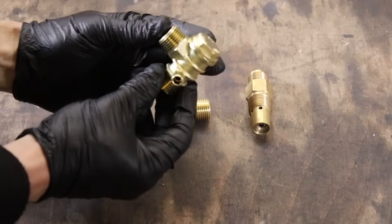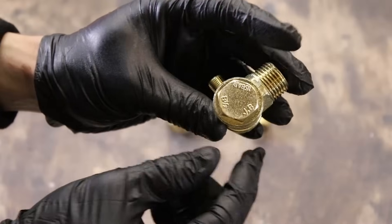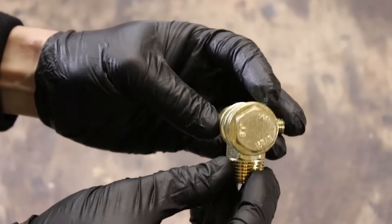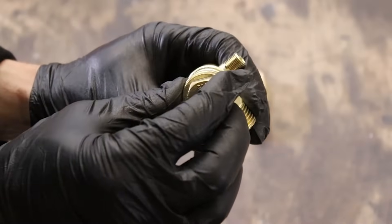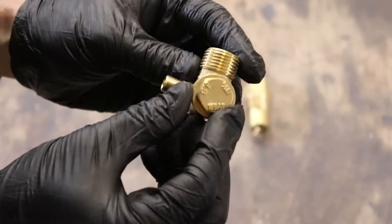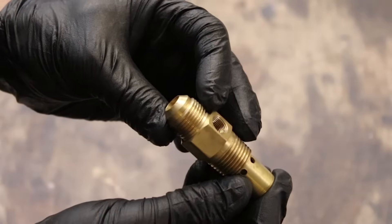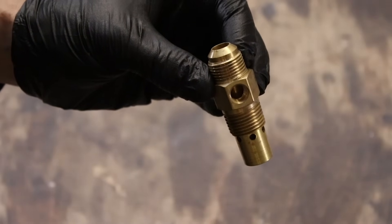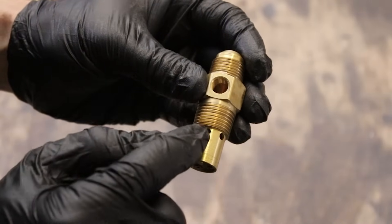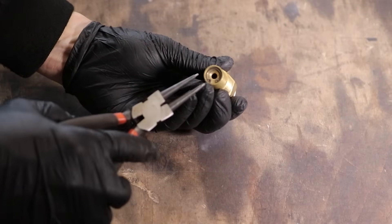Here we have a few different examples of various check valves or non-return valves fitted to air compressors. They all look slightly different but in principle they're pretty much exactly the same. This is the port to the exhaust valve, that's the port to the air vessel itself, and that's the end cap which can be opened to service the valve inside. Here's another one — pretty much the same, just a little smaller. Same three ports and simply another design. That side goes to your exhaust port, the main charge pipe comes in here, and these holes are where the air goes into the air vessel itself.